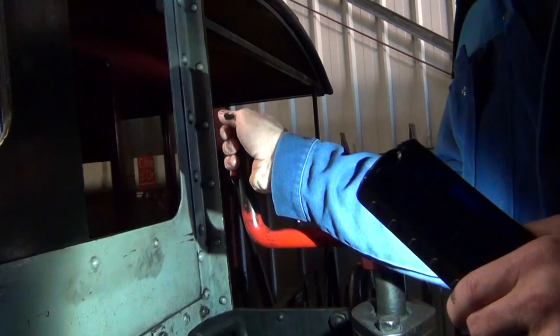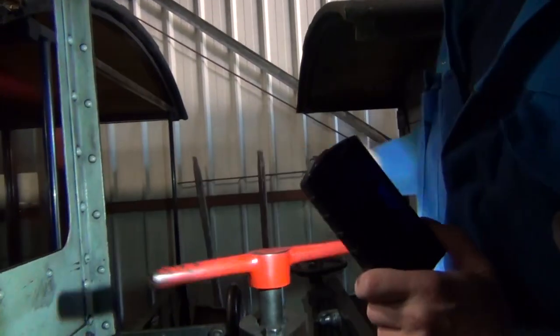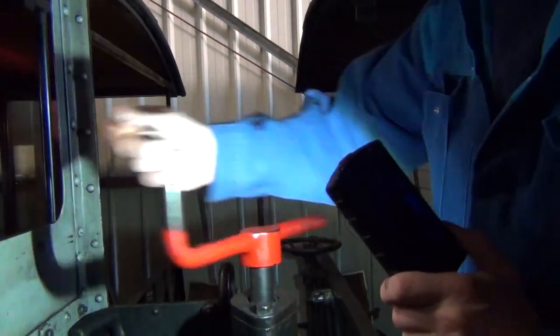I said I would verify my hand brake. My brake is applied. That means there is no anomaly. I will look at the number of turns applied — it has been tightened sufficiently. This proves I still have travel remaining, so I still have a safety margin. I will keep the brake applied since we are about to move the loco, which is sandwiched between two other locos, so it cannot move.